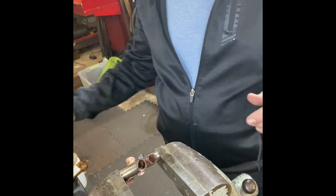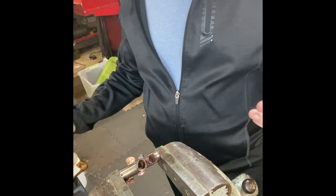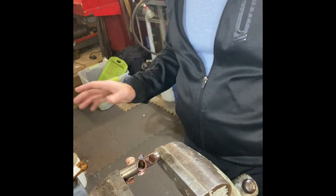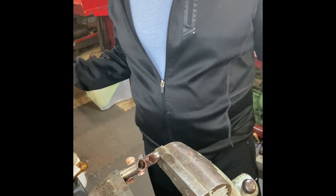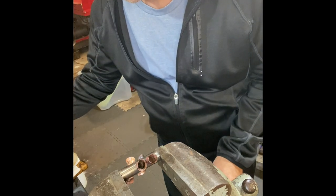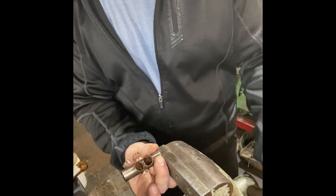The initial four opening steps are done. I've got two steps basically left — I'm going to open it to 437, to 7/16, and then to the bore size, whether that's 450, 540, 580, or whatever it's going to end up being. You don't want to hammer the last steps open. To get a nice smooth finish on the inside of the piston and liner, you want to be able to spin it as you're going. What I use in lieu of a giant drill press or anything dedicated to do this is a hammer drill with a bearing on it.